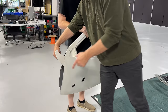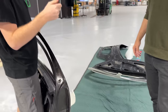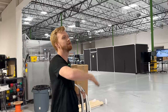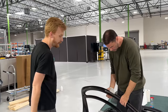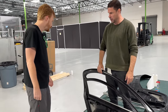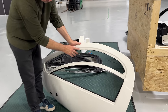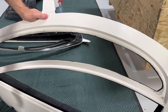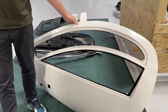There's a strut that attaches right there and pushes the door up. From the app there's a button for opening both doors — not just the driver's side — and when you push that button both doors open. The window and glass will probably about double the weight of the door once you have the mechanism and the six-millimeter glass in. You've got the bonding features — that checkerboard pattern gives a little more grip — that's where the top window gets bonded in, the seal goes on here, and the window rolls up into the trough. Very aerodynamic — we're able to streamline the rear edge really nicely.